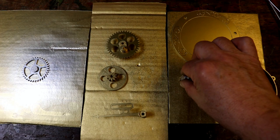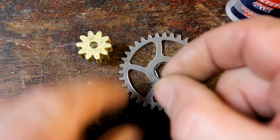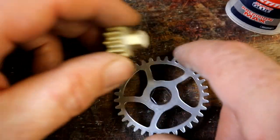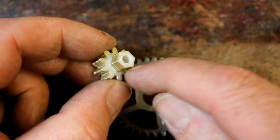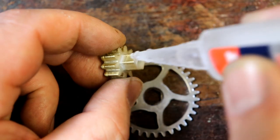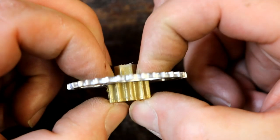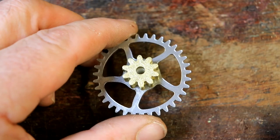While the rest of the paint dries, this gear and this gear are now dry so we can fix them together. To fix them together, remove the little paint mask — that hasn't got any other future purpose so feel free to use it elsewhere. You can see there's no paint around the centre. If using another sort of adhesive just dab a little bit around here — not too much so it squeezes out everywhere. I'm going to use super glue — just put a little bit on each of the hexagons, then push that through the painted side of the gear. If it's a bit stiff just squeeze it together in the centre to ease it together, and don't pull it by the edges because you could snap the gear. That looks really nice — a multi-coloured gear, fabulous.